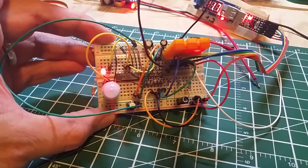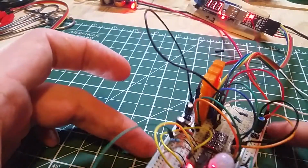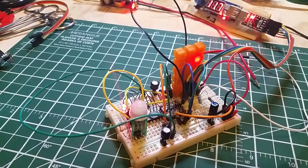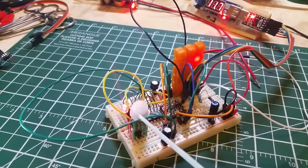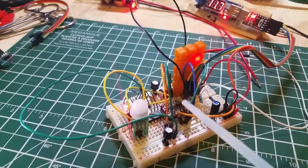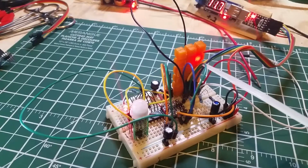The board is not anything too special, and the mock Terminator CPU just has that wonderful red glow, and the camera probably can't see it. I'm gonna have a look right here. When this sees motion, and this LED is lit up, which is actually, oops, jabbed it. This little LED is actually on the I2C expander. When that's lit up, every so many seconds, the ESP is going to transmit through the serial bus that it's seeing a motion. And when it does that, you'll see there's a little blue flicker here.